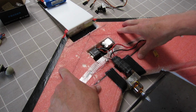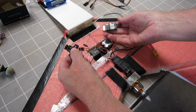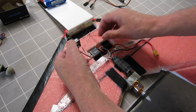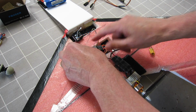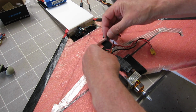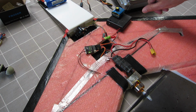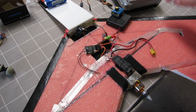I'm going to set up my flying wing with the Foxeer Arrow FPV camera and the D4R-II receiver. Get rid of that, I don't need a voltage checker anymore because that's going to show up in the on-screen display. And get rid of that 8-channel receiver, I only need 4 for this one. Now I just need to bind this to my Taranis before we can get started, so I'm going to do that now. Put it into bind mode. I'm going to use this switchable battery. Push the button down, turn the power on, we're in. Get out of bind mode, turn it off. Power. There we go. We're in business, just have to program it up.